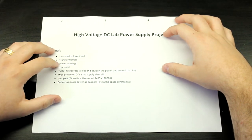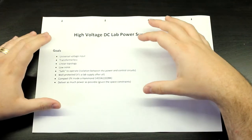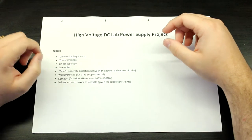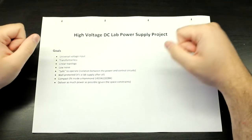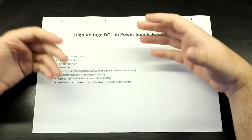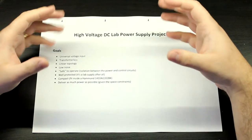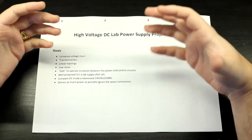It's going to be linear, because of the low noise requirement. So I'm going to make sure that it's very much a low noise supply. And it's going to be linear, so it's not going to be as powerful. It won't deliver like 300 volts at 1 amp, okay? Just forget about that. It's going to be more geared towards that sort of low-end stuff, like Nixie tubes and some valve amplifiers,